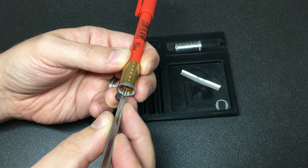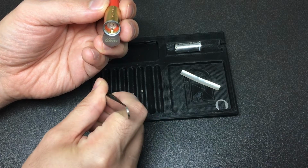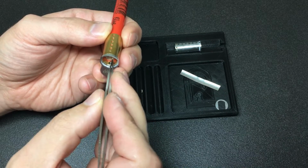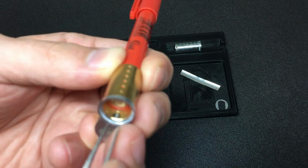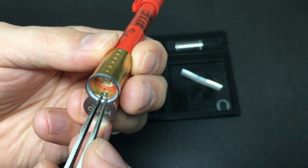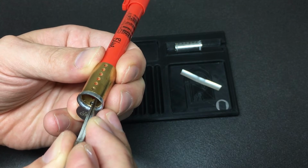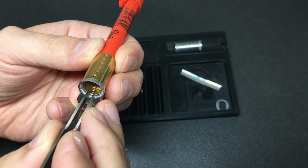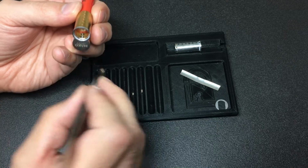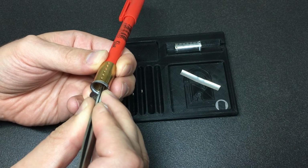Got to get these pins as they come out just right. So this one is going to go exactly the way up it's found in the lock, corresponding with the correct pin. And the reason why this is so tricky to put back together is because this centerpiece is floating, and therefore if you accidentally twist it, you can trap these springs, and putting these together is just unpleasant. I'll do that off camera because it'll involve lots and lots of swearing.